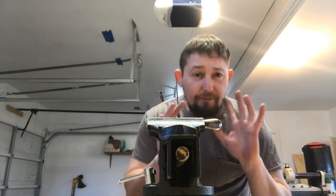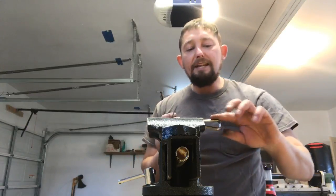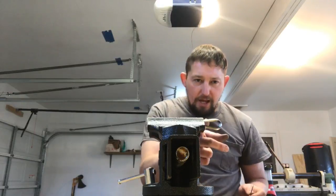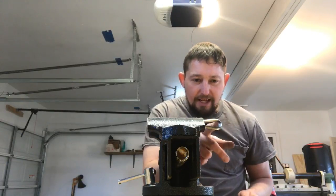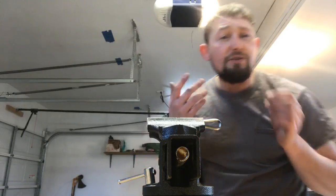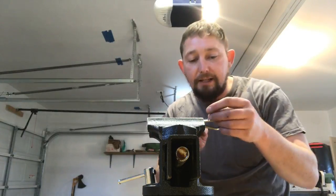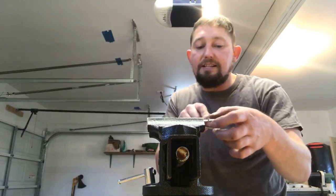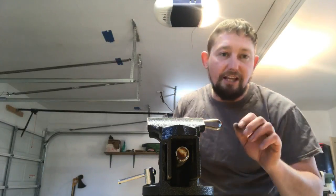When we remove metal for any type of decoration, anytime you do that, you're weakening the frame a little bit. So I avoid doing them right on the outside bends and on the inside bends. This straight area here, I can remove small amounts of metal for a decorative effect without harming much of the structural integrity, because this is 3/16 inch steel. It's pretty tough.